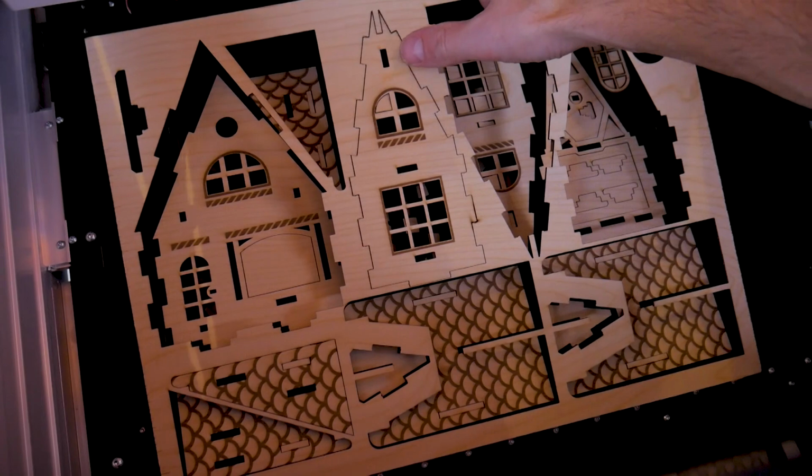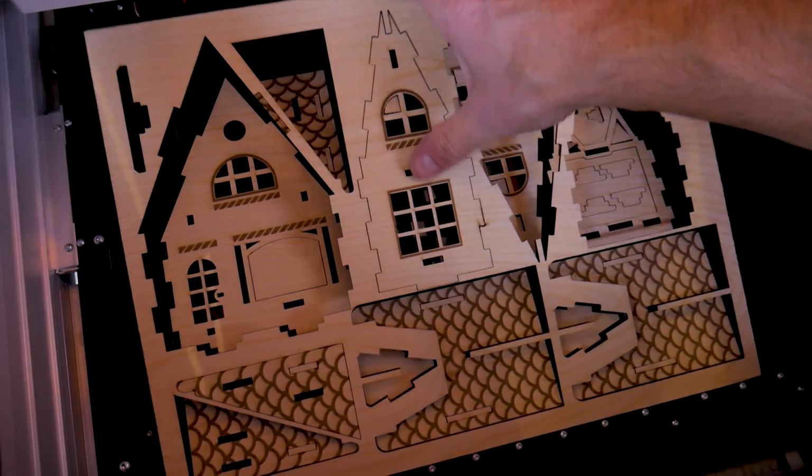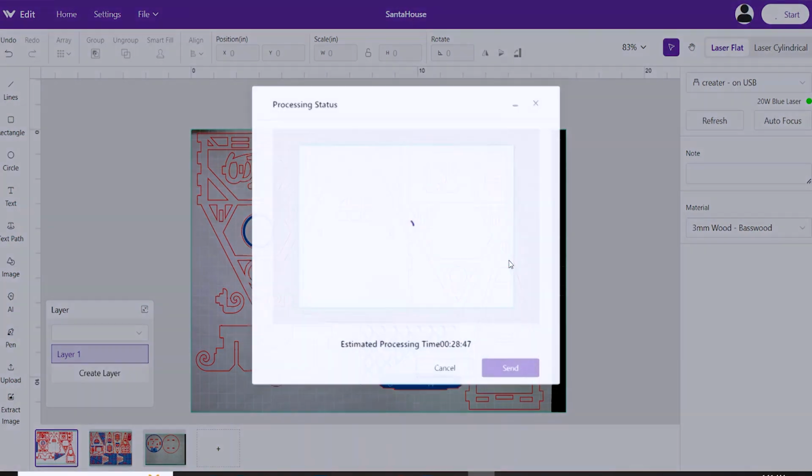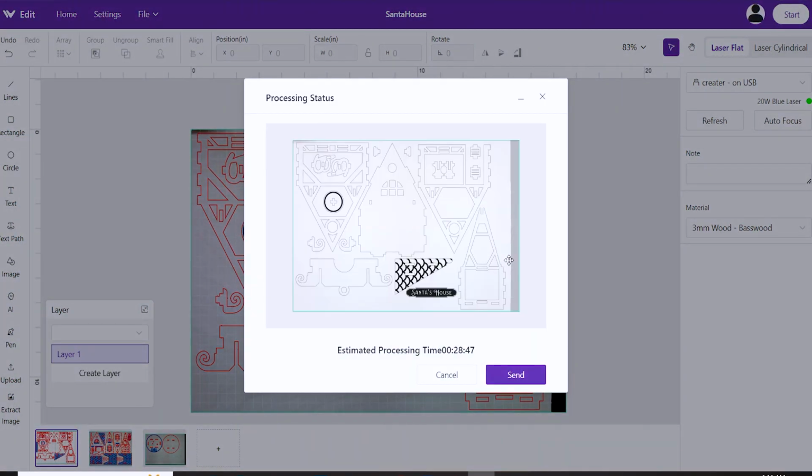With the exception of one or two parts, which I could easily break away once outside of the machine, all of the through-cut parts just fell out of the original workpiece. Therefore, I'll leave all of my settings unchanged, and we'll process the final sheet of our design.